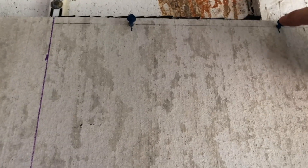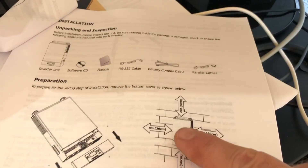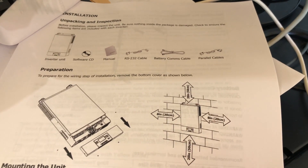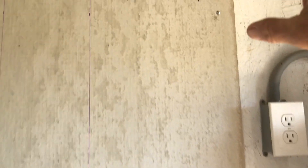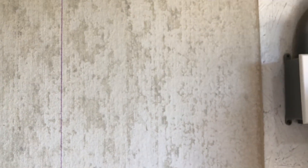This is a three-inch bolt going way back into the block. Give yourself enough gap here to hang onto. From there, you want to make sure you give yourself the clearances noted in the manual: 20 inches on top, 20 on the bottom, and 8 on the right and left. Do your layout and make sure you have enough tolerances — they specifically state this is to allow for heat dissipation and good airflow.